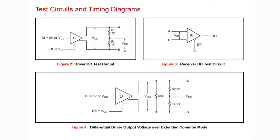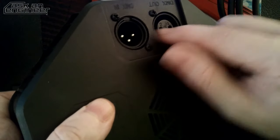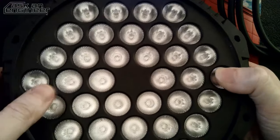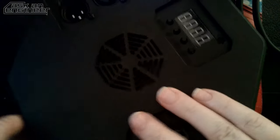You can have multiple devices. One of the great things for lighting is that lights can be multiple meters away — you can have hundreds of meters of wiring. I just picked up a light because I was curious about it. This is a low-cost par light, and even though there is an input and output, they're not separately labeled — DMX out and DMX in are actually wired together. They just want you to have one cable per connection, but these are electrically connected. You can have up to 32 devices per chain and 512 addresses. They max out at 32 because the capacitance of the line per device starts to become intense. If you need more than 32 devices, you'll want to put a repeater in for better capacitive drive.